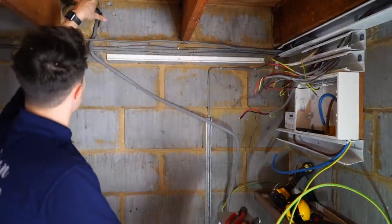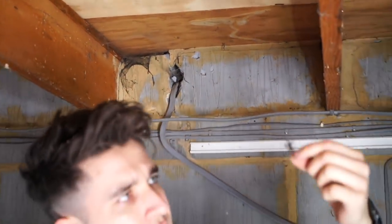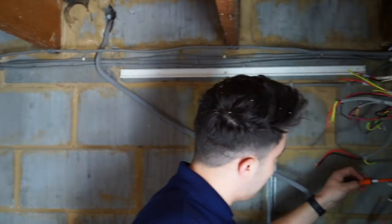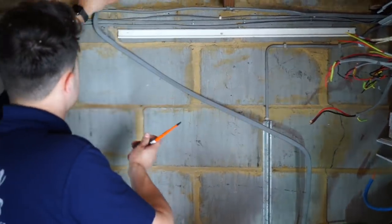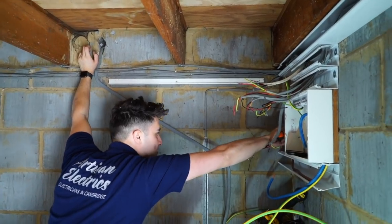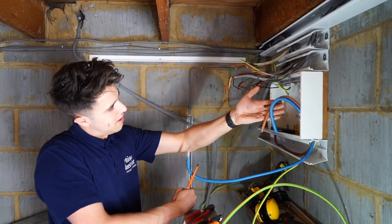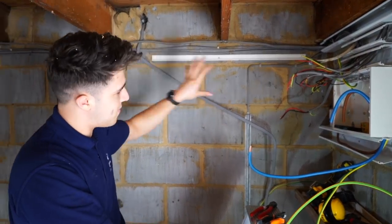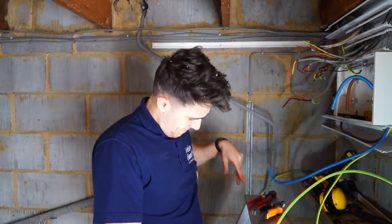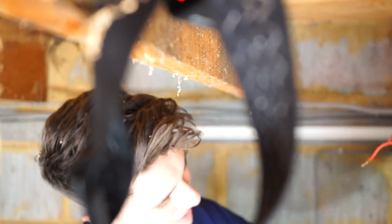Oh mate, that is a beefy spider - I think it's dead. So it had single insulated cable and looked pretty rubbish. I'm going to put a junction box there, through-crimp a bit more 10mm, slightly bigger, bring that down neatly into the top of this trunking, then into the meter, out of the meter, into the consumer unit with proper tails. That way if they ever decide they want a bigger supply, they only have to bring it to the meter - they don't have to pull out the main switch. I didn't flinch - you flinched. That's so unnecessarily cinematic, I love it.